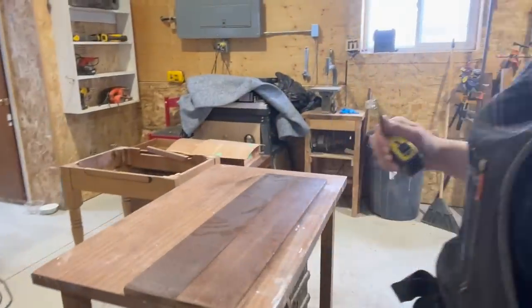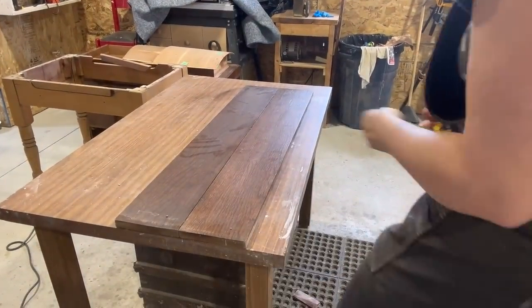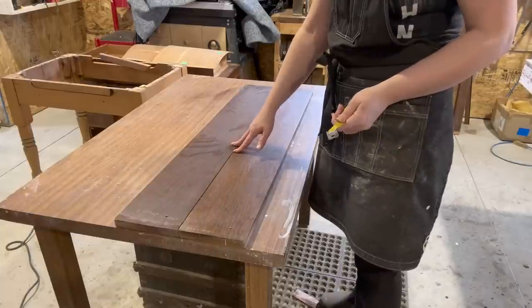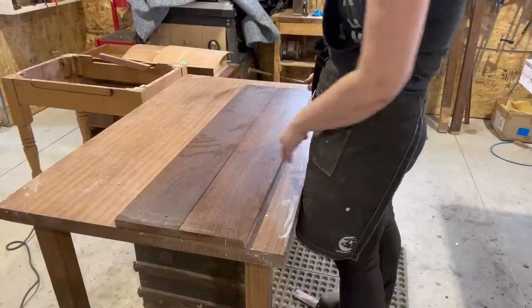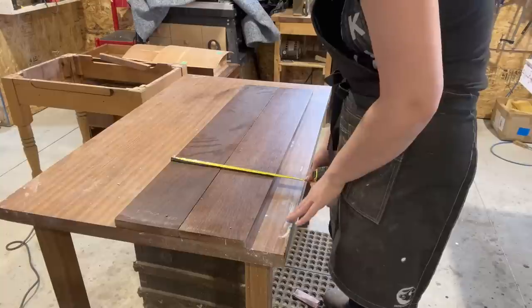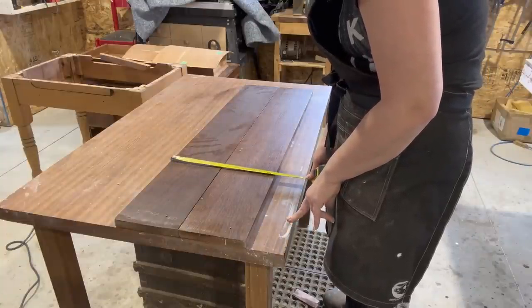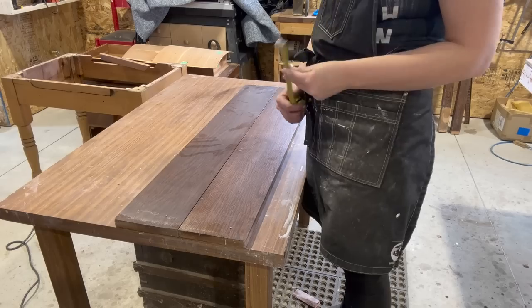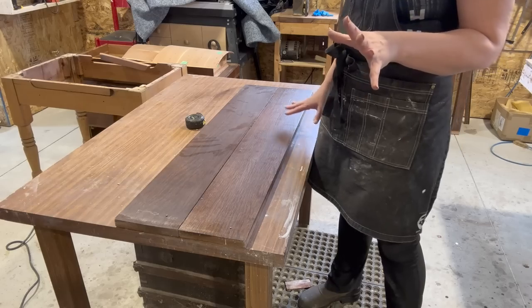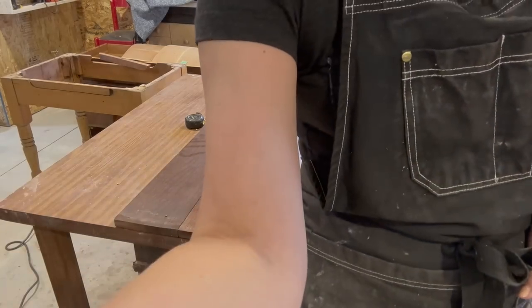The wood that I've got here is nice old oak, so that'll work great, and it came from the same house, so I'm gonna try to save the finish. Not sure if I'm gonna get that, but I'm gonna throw one edge through, or both edges actually, through the jointer, and we should end up with just over 1 foot, which is plenty to fit in there. So let's take these over to the jointer. I've checked them for nails, but I don't wanna deal with that, and get these edges nice and ready for surface plane or jointing.